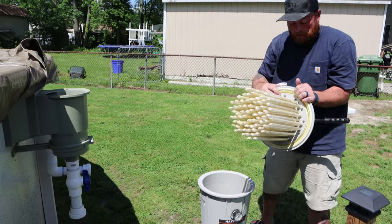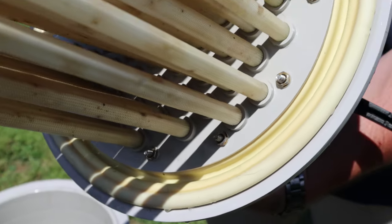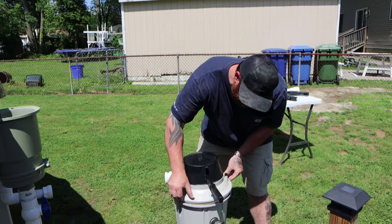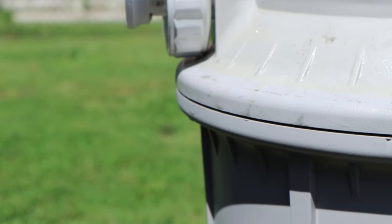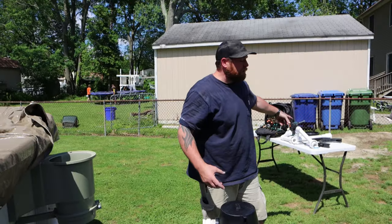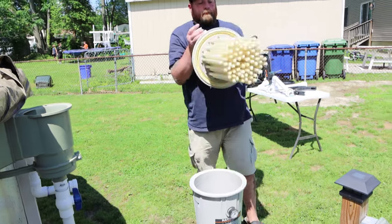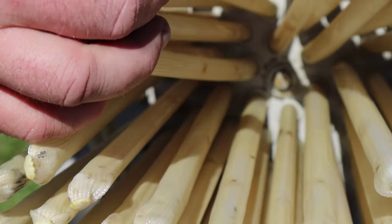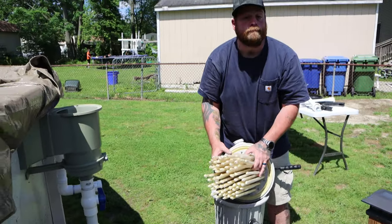Make sure you put it in properly. Here's the seal I was telling you about — if you get a leak, you've got to make sure that this seal is clean, properly clean. Once this comes on, it's going to go back inside and sit in that groove right here. Then you can turn it whichever way you need to make the pipes connect — the clamp will go on, squeeze, create the seal. If you're getting leaking out of there and you've got it tightened on as much as you possibly can, it's time for a new finger filter media. Located in the center is a stainless steel pin with a C-clip. You pop that C-clip off with a screwdriver, these pop right off, and you can change them out. Go to any pool store — they should be able to at least order you one if they don't have it in stock.